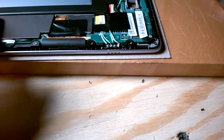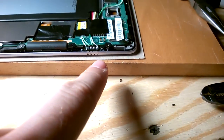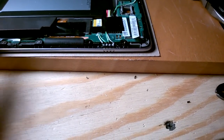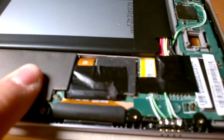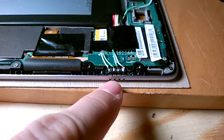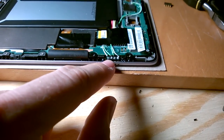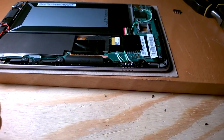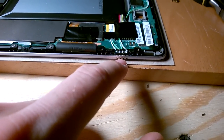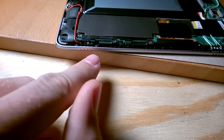Just like I showed in my other video, my power switch still works and I'll have an external switch — once this is slid into the dock — to restart the tablet or whatever I need to do. The other two wires are data wires: data plus and data negative. So on these four pins I have switch, switch, data negative, and data plus.